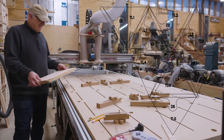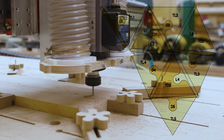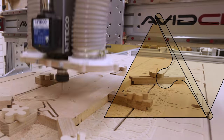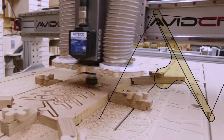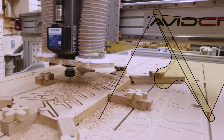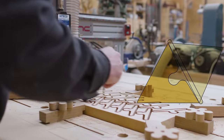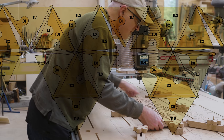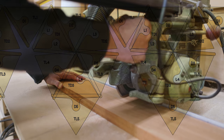I needed to make both the insert pieces and the triangles themselves, with the insert cut out. The way I thought about doing this was to make an insert that runs along one edge of the triangle and brings a tab of the adjacent triangle's wood color into the triangle that has the insert. The tab pattern of the puzzle crosses the seams between the triangles. So I cut out the inserts first, so I could size the holes they're going to go into in the triangles.